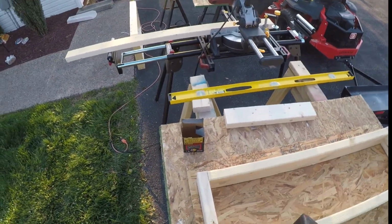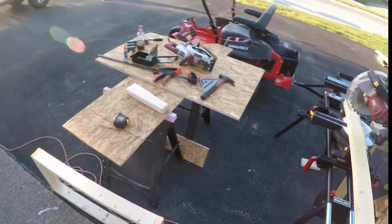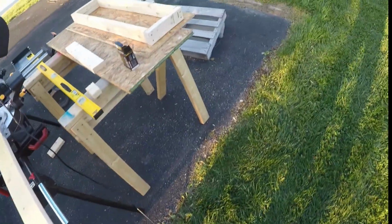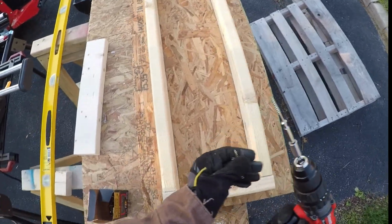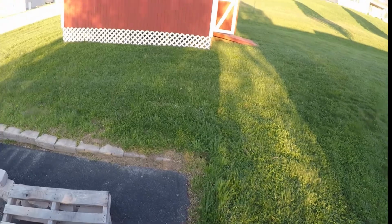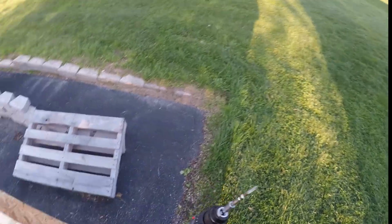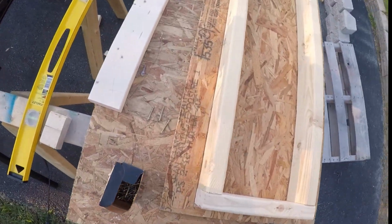And I'm probably going to change this bit because these are 20 and this is a 25. So Torx 20. Started using these screws a while back when I'm doing some projects. When I built my shed, I used those for several things. Actually, I put the floor down with just regular nails, and it's already kind of working loose, so I'm going to wind up putting these in and to fix that issue.